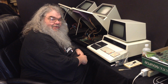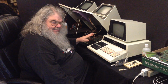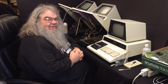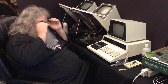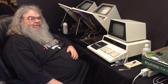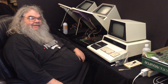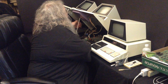yes, definitely get rid of the sockets, see what's what, because I'm confident that with new sockets, or, God help us, if I put the chips directly into the board, that I'm not going to do, that everything would be fine. I could also look and see if there's any trace damage, but like the chocolate, I don't know where it came from, I don't know when it got there, I don't know how it happened, but it is right down into the pins. And the last time this machine stopped working for me, it was a very similar situation, in that it was after I had diddled with the RAM a little bit that things went poorly. And right now, it is plugged in, and I know if I turn it on, it makes all the right noises.